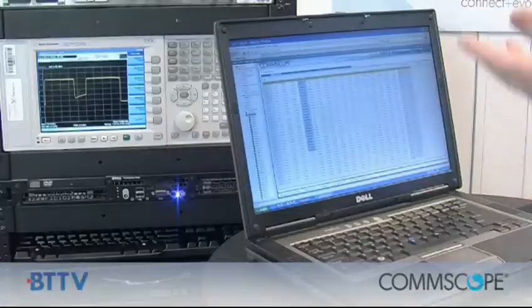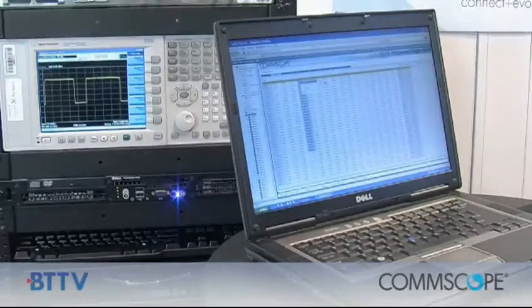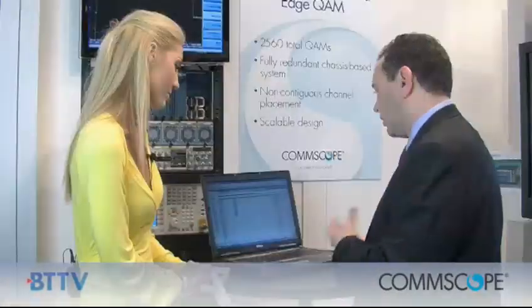What kind of flexibility does this have? Well, we have the total flexibility of being able to control any individual QAM. They don't need to be contiguous or adjacent to each other in any way. So we can control blocks of channels or we can also control individual channels. We control the device through our web-based, Java-based application, accessible through any web browser. You log into the device and then you're able to control individual QAMs or groups of QAMs.